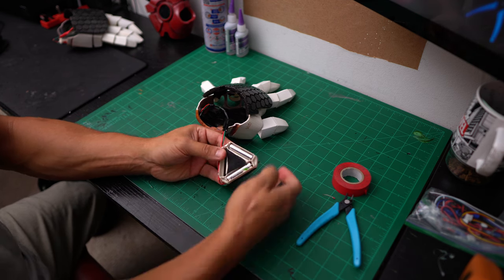So this next one is going to involve a little bit of weld repairing. I said I might not weld it before, but I think I'm going to at least try to tack weld this back on just to hold it in place, and then reinforce the inside in a way that will ensure that if it breaks again, the part will never fall off. We're going to run elastic or nylon straps down this entire piece so if it ever breaks off again, it'll stay in the same position — it'll just have a little bit of flex to it. If you ever need to weld repair a 3D print that breaks on layer lines, the infill is going to be your worst nightmare trying to fill in blank space. Having a little bit of extra filament to fill in the gaps can really make or break how strong that repair is going to be — definitely keep some on hand.